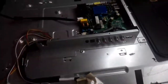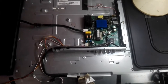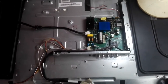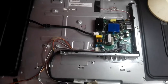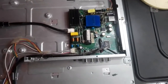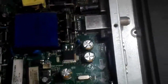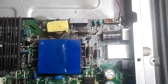This is actually an easy one — I already have an idea what the problem is. During the visual inspection I saw some brown spots on the motherboard. This is common on almost all LED TVs: the logo shows up and then it goes to standby, or it powers up with no display, or it just flickers on and off.